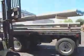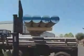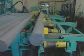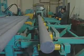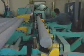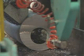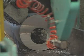Aluminum for scuba tanks arrives in solid billets 18 centimeters, 7 inches across, and 5.59 meters, 220 inches long. Saws cut aluminum slugs the proper weight from the billet. A standard U.S. 80 cubic foot scuba cylinder requires approximately 14.5 kilograms, 32 pounds of aluminum.